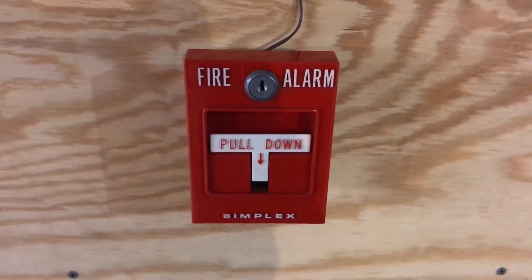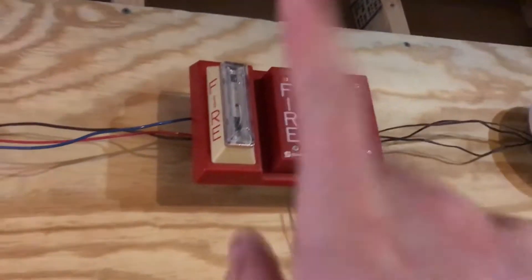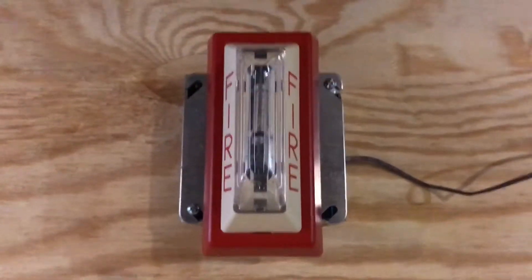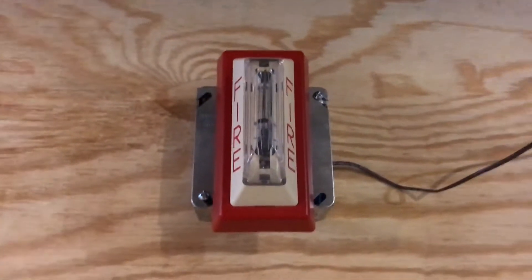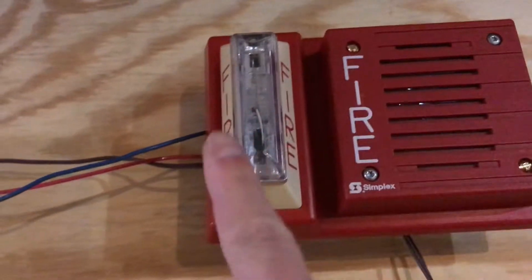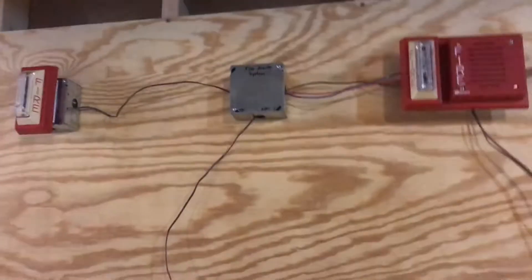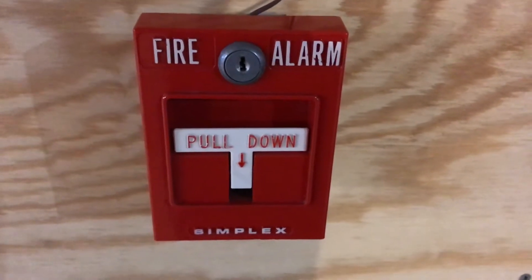So we're going to get started by pulling the 4251-20 — it's very easy to pull, by the way. Of course that will be doing March time. That strobe is going to be coated so it's not going to be flashing as much. This one is not, and it flashes at a high rate — it's 100 candela head-on, even though there's no reflector in there. It's just at the front, 100 candela head-on. It's not as bright from the side obviously, whereas this one does have a reflector so it's bright from the front and the side. That one is 15-75 or 15 candela, and that one's at 100. They are different models, built differently, and they were made by Gentex for Simplex. Anyways, with all that said, we'll get on with this.